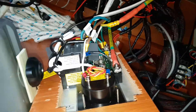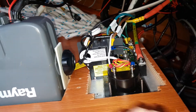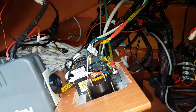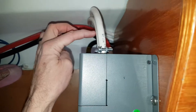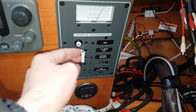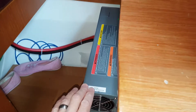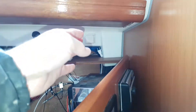Looking at the back of the main breaker panel: the main breaker is wired to the pony panel back in there. What I've wired in between them is actually an inverter-charger — it comes in here and goes out there, so it's an inline inverter-charger. As soon as I activate this breaker, voltage starts flowing in and also powers the panel over here. I can be on shore power without really using my battery, and it does charge the battery inline, giving me power to my courtesy plugs.